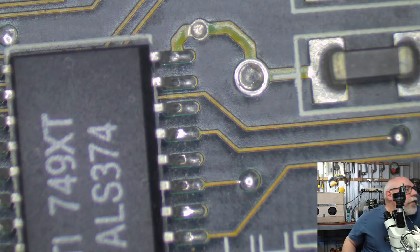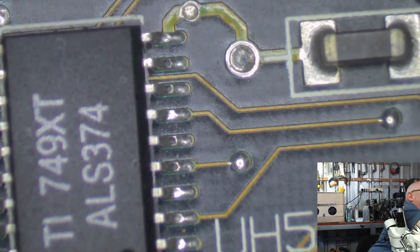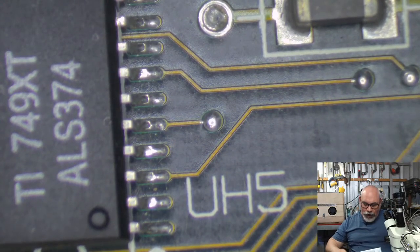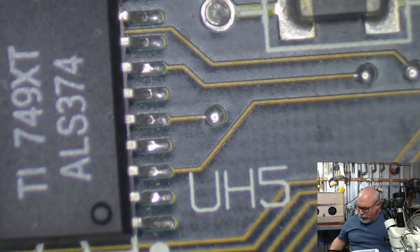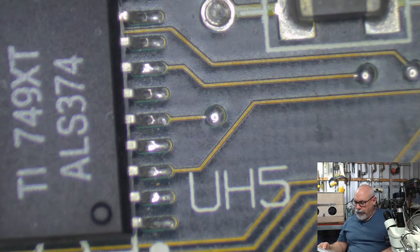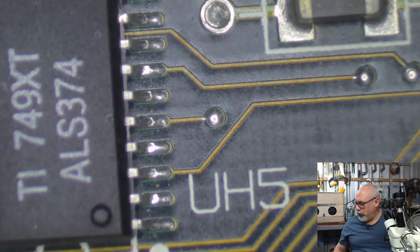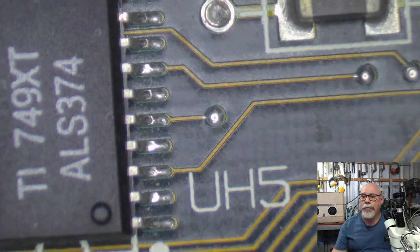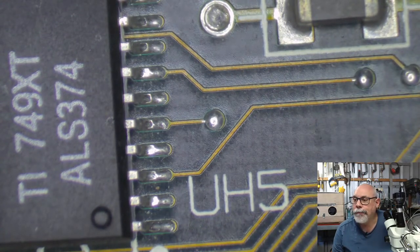Right, now I wonder if anyone could tell me where I would find some sort of guide on how to recap one of these Mac 2s, where the capacitors go, that sort of stuff. I wonder if there's a website that talks about recapping things, maybe called Recap a Mac. That'd be a good name for a website like that. This is the revision B board that we're looking at at the moment, as opposed to the revision A board. So there it is, Recap a Mac, and you will find links to cheat sheets like this one that show you what caps go where. Some of them actually have information on where to buy the caps, so eventually they all will, but at the moment they don't.